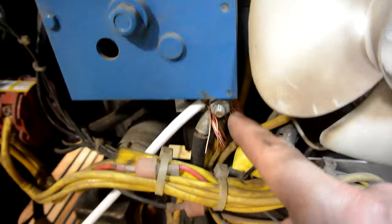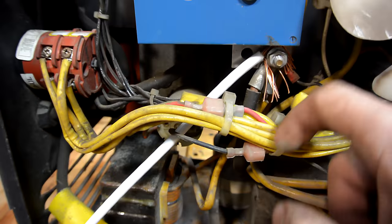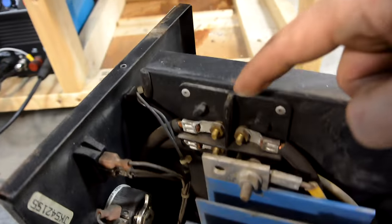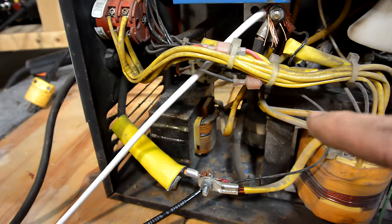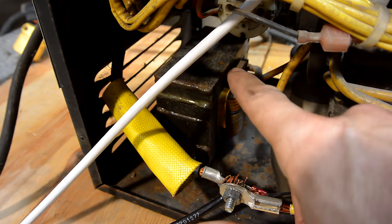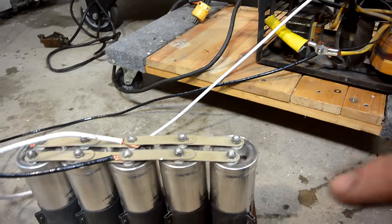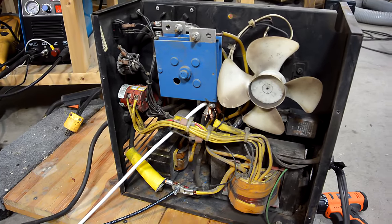The output of the half-bridge rectifier now goes down to the plus side of the capacitor, and I've run another lead to my capacitor bank. From here, it also goes up to this, which allows switching the polarity on the other side. Before it goes out to the leads, it goes through this thing here, which is the inductor. So there's an inductor between the capacitors and the electrode. I had my capacitors hooked up after the inductor, because I had it on the output, whereas now I've got my capacitor bank in parallel with the main capacitor and before the inductor, so hopefully that'll work a little bit better.